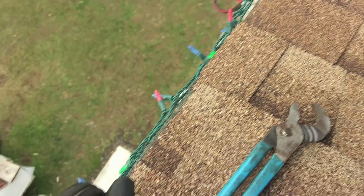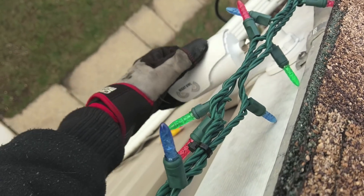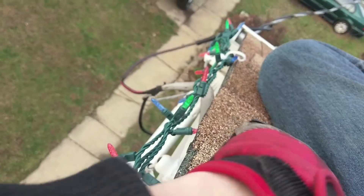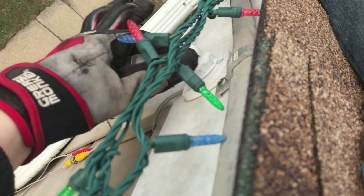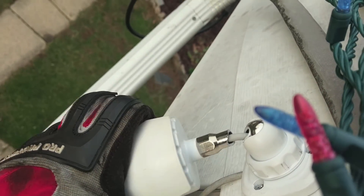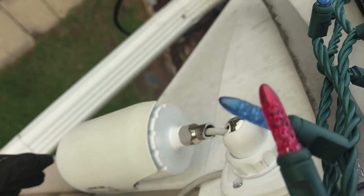Here's a little tip: when you get your camera cranked down and want to adjust it, loosen it up before you break the little thing. The stem on this camera is real fragile. I've been using pliers to tighten this lock ring because it's hard to turn by hand. I thought I had it loose enough to still move the camera around, but that was not the case. When you're going to adjust these things make sure it's real loose, because that little toothpick will pop right off.